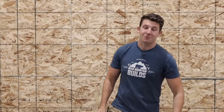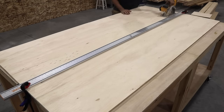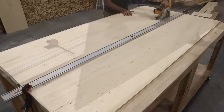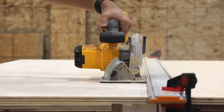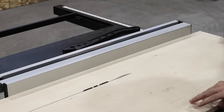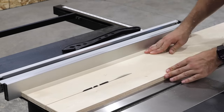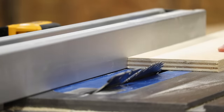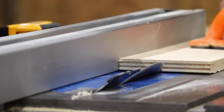And we're gonna start this off with stripping out our cleats from 3/4 inch sanded plywood. I'm stripping down 3 3/4 inch sheets of sanded plywood, starting off with cutting them in half to make it a bit easier to run through my table saw. From there, I stripped each piece down to multiple 5-inch sections. With those cut out, I'm setting my blade to 45 degrees and bisecting each of my strips into 2 cleats. The long side of each cleat measures at 2 3/4 inches.